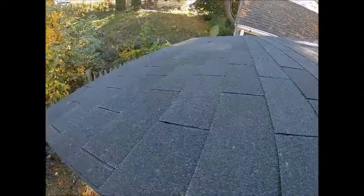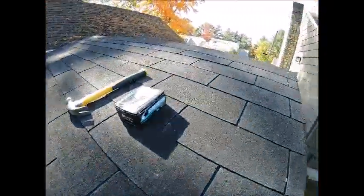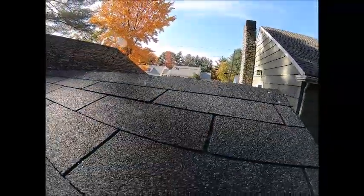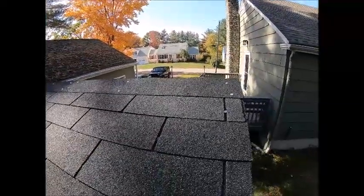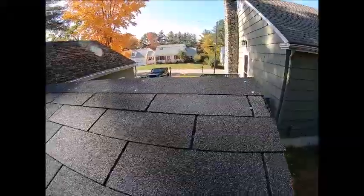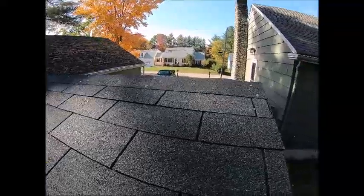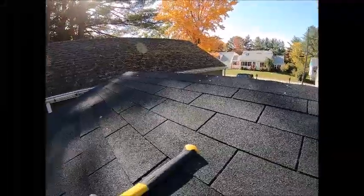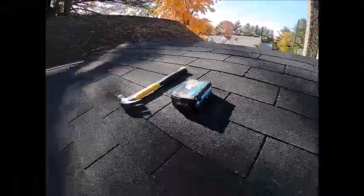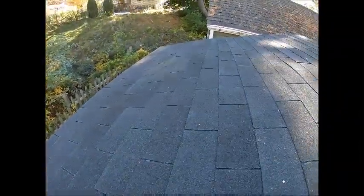All right, got the roof all nailed on. Problem with these lean-to roofs is there's no good way to really do the top end. So what we did was we cut a shingle in half and just ran the full strip on it and nailed it down. And then I'll probably just cover those nails with some black caulking or asphalt or something to just seal them in. But yeah, other than that, it's really just standard 3-tab roofing job.